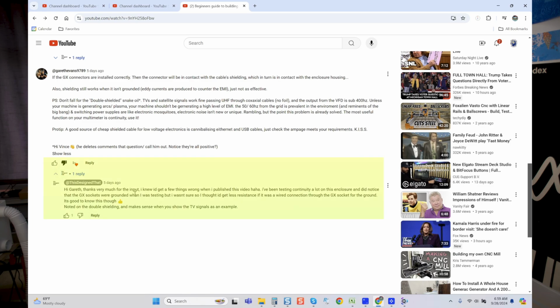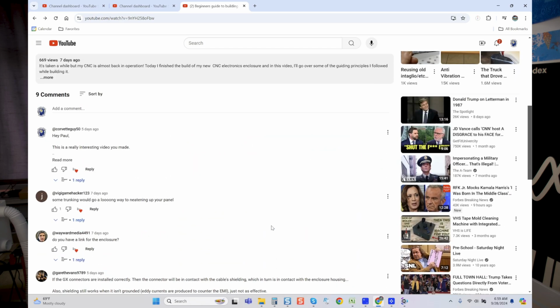"Hi, Gareth. Thanks very much for the input." Of course, he left his heart. "I knew I'd get a few things wrong when I published a video, haha. I've been testing continuity a lot on this enclosure and did notice that the GX sockets were grounded when I was testing, but I wasn't sure, so I thought I'd get less resistance if it was wired connection through the GX socket for the ground. It's good to know this, though. Noted on the double shielding, and makes sense when you show the TV signals as an example." Is that interesting or what, guys?